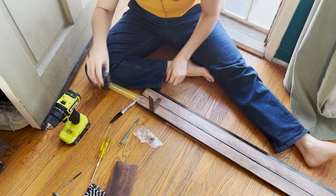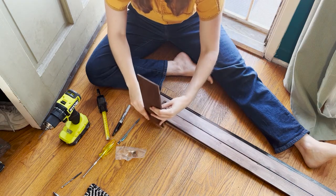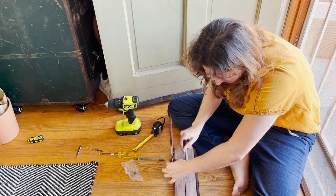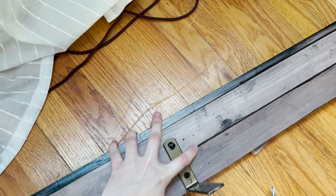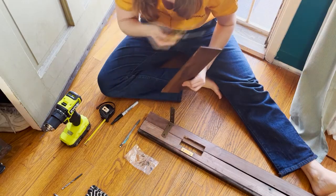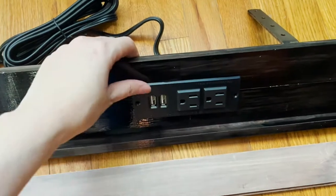I've decided to use some L-shaped shelf brackets I found on Amazon — linked below — which provide two wall attachment points for much higher weight capacity. I'll go four inches in on each side, using an off-cut piece to simulate the wall and ensure everything is straight. Clamp the pieces together while screwing to prevent gaps, using the brackets almost as braces to keep everything as close together as possible. Then insert the plug and secure it with screws — and she's done. Well, not quite — we've still got to install it.